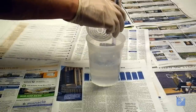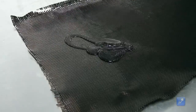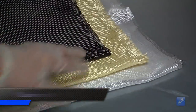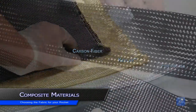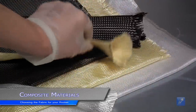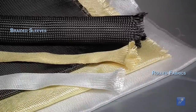Composites are a woven fabric material comprised of high-strength fibers. Pieces of these fabrics are layered together and held in place by a two-part epoxy or polyester resin. The resin is mixed together as a liquid and it hardens, fusing the laminate together. There are many composites to choose from — fiberglass, carbon fiber, and kevlar, just to name a few. Each comes in multiple thicknesses or weights, and composites also come in different forms such as fabric rolls or in a continuously braided tube or sleeve, even with different weave patterns to maximize the ability to conform to different shapes without wrinkling.